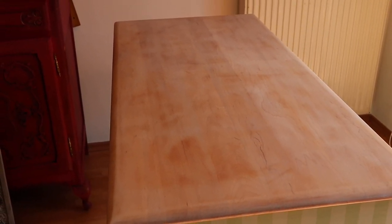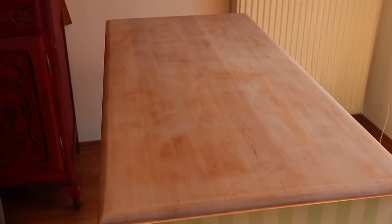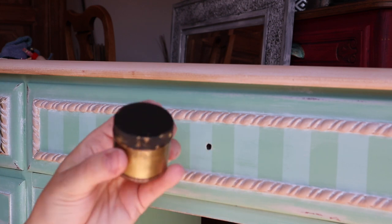So it allowed us to put some white wax on there, lighten up the wood a little bit, but keep that blonde wood still. So again, this is after I went and buffed it just with a rag 15 minutes after. And with Dixie Belle products, I may put some Gatorhide over it. You can put Dixie Belle's clear coats or Gatorhide over their wax. They're designed to work together, so I probably will put some Gatorhide over this as well, just because it's a desk.